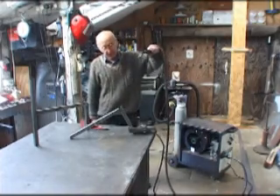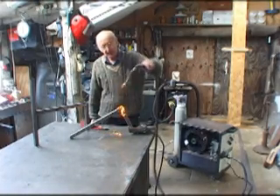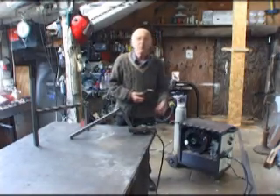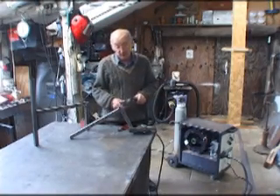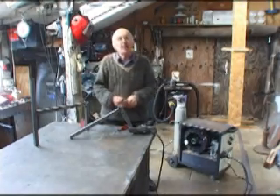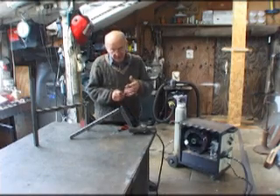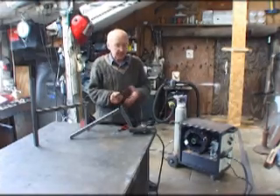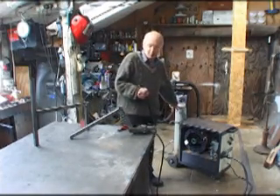It's almost a bit like melting a fuse when they touch. If the torch is close to the metal it focuses the heat and it gets hot enough so it will melt the steel itself — so it's steel wire and steel, and they all completely fuse together and all become one, and that's the weld. The only thing is that the temperature is so high that the oxygen in the air would oxidise the metal and make it weak. So it has to be shielded by an inert gas — that's what the cylinder on the back is. It's carbon dioxide that I use.